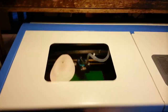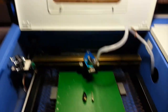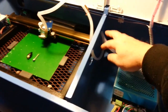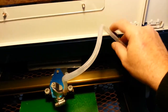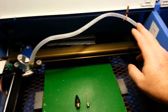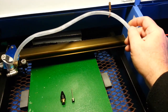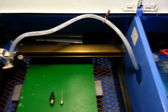The air assist was fairly simple and straightforward. There's a port that makes it easy to bring the hose in from the compressor connection through a wide opening so that it allows it to pull. I did add a spring system to it so that the hose stays out of the way as the unit moves around. I used the existing hose from the water pump because it's flexible — it's easy to kink, but I think the air pressure will hold it open, and I'd rather use it here than on the pumping system.